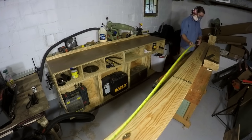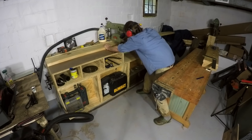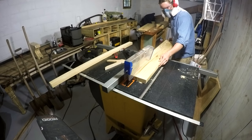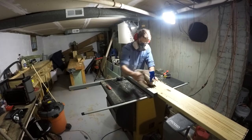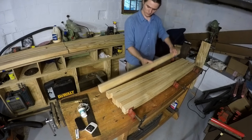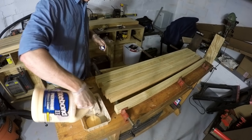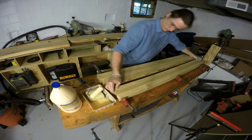This is going to be a pretty long but fast-paced video using a lot of tools and techniques. I first start out by prepping the lumber for the top, using two-by-tens ripped into about two-and-a-quarter or two-and-a-half inch sections. That dimension doesn't really matter — it just depends on how thick you want the top to be — so I'm ripping these oversized because after it's all glued up I'll plane down these sections before joining them into the full top.